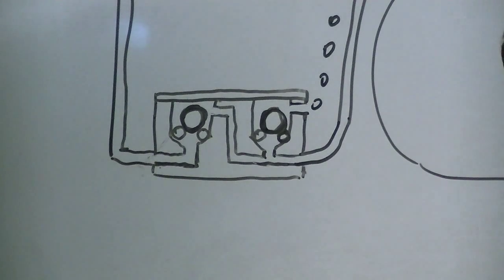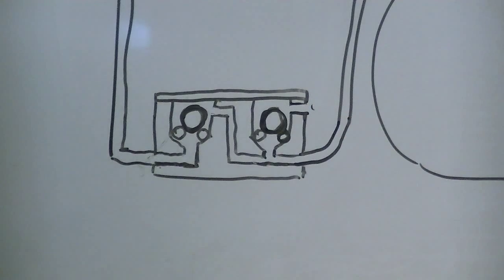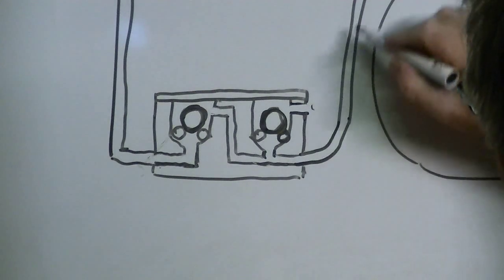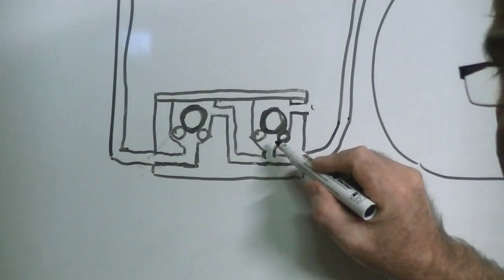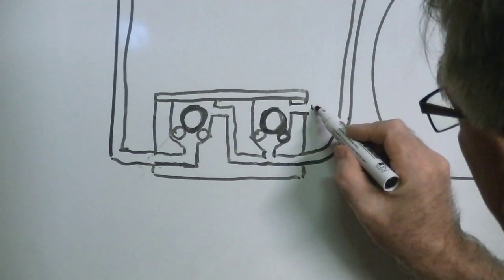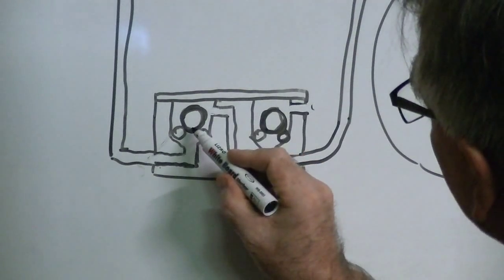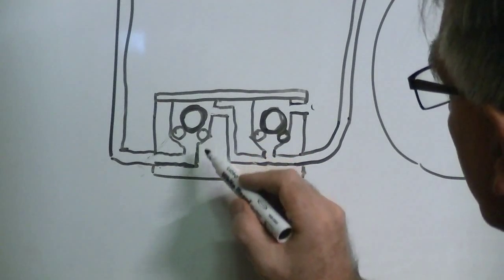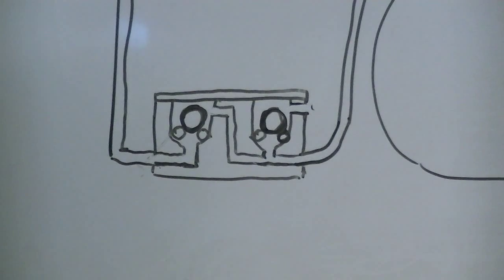What happens when you want to suck the water out and suck the water in? What happens is fairly obvious. You're causing this sucking motion which in fact is causing this ball bearing to be sucked down onto this O-ring, so that the water from the outside can't get through — so that's sealed. But what you're doing is you're pulling this ball bearing off its O-ring and allowing the air to come in through. Very simple process, and it controls the flow of air into your tank.